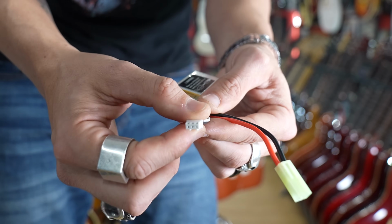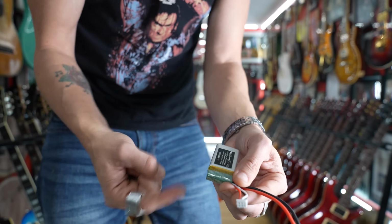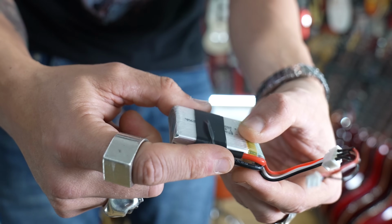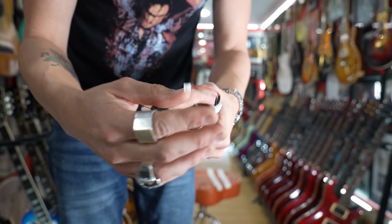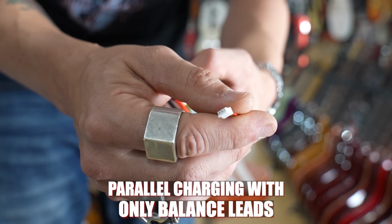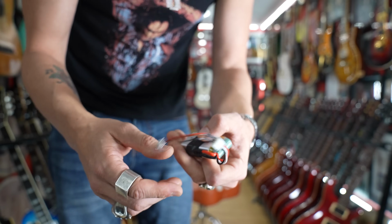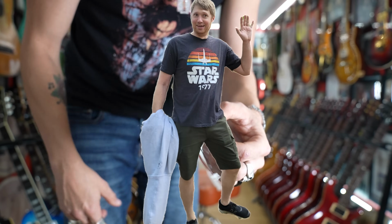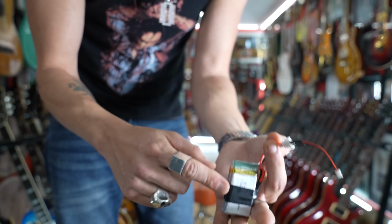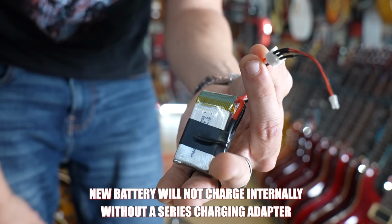And this is how it charges, because lithium ion batteries are basically like multiple batteries grouped together into cells. I had to cut off the main discharge lead. So the way that this was designed from Gibson was they used a balance port and a discharge lead as one cable. So basically all the power is going in and out of this little itty bitty head. So what I did with my buddy Kevin, and when I say what I did is Kevin and I talked this through, Kevin basically hot wired this to one of these batteries, and then when I went to charge it again, it killed an entire cell and I wasn't able to do it.